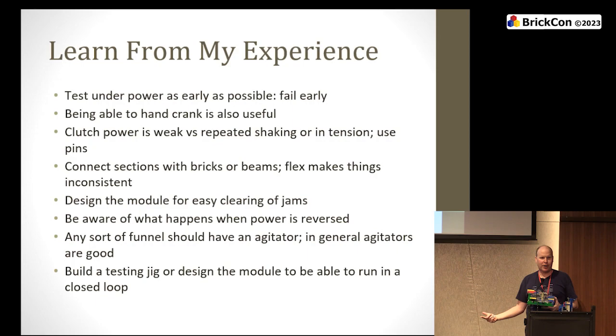More insidiously, it'll work right at home and not work right after you transported it somewhere — that's going to happen. You're going to put it in a box, it'll work fine on your test bench, you'll take it to a convention, take it out of the box, and something new is going to go wrong. You want to minimize the number of those somethings. Connect the sections. If you make your modules beautiful, make sure you can still access the mechanism. Balls will get places you didn't think they could get — many of those places block your mechanism. Put a hinge on your decorative wall so you can open up and get to what's inside. Put a hinge — include it in your design. In future you will be very happy about it.